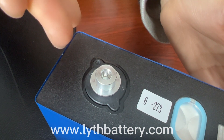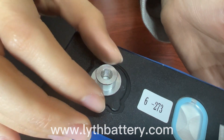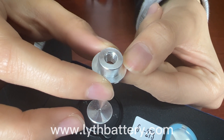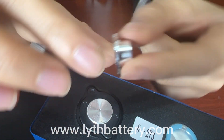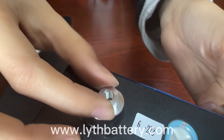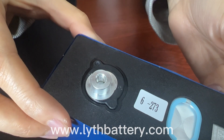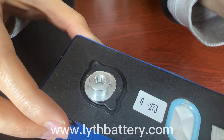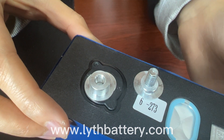Let's take a look at this welding screw hole. The depth of the screw hole is only 6 mm — the depth is smaller, so the torque is also smaller. Screws come off easily, so the seismic resistance is slightly weaker. The electrical conductivity and contact pressure are similar to welding studs.